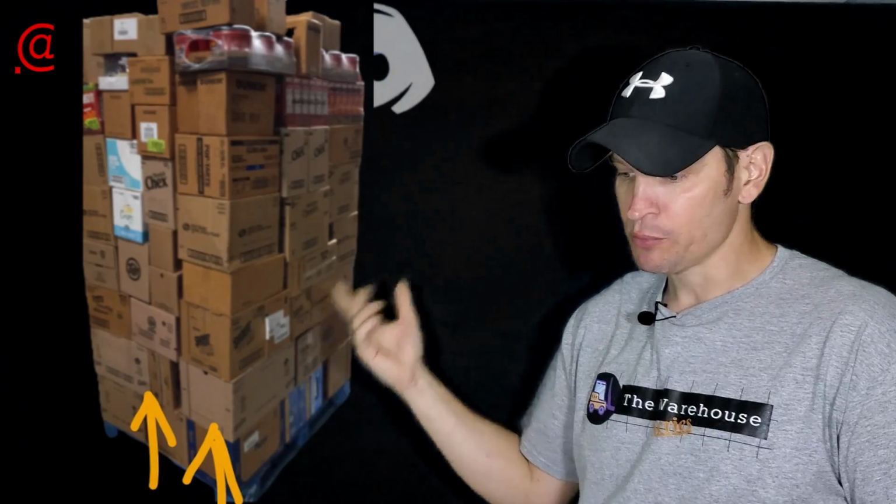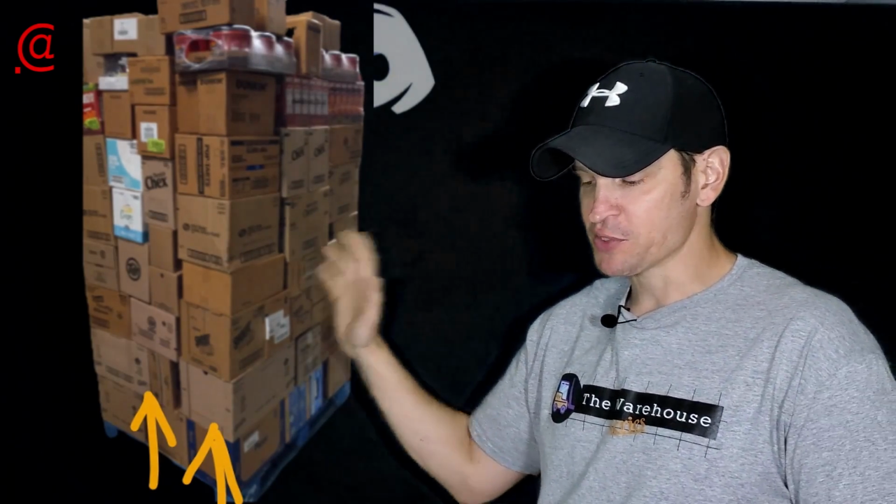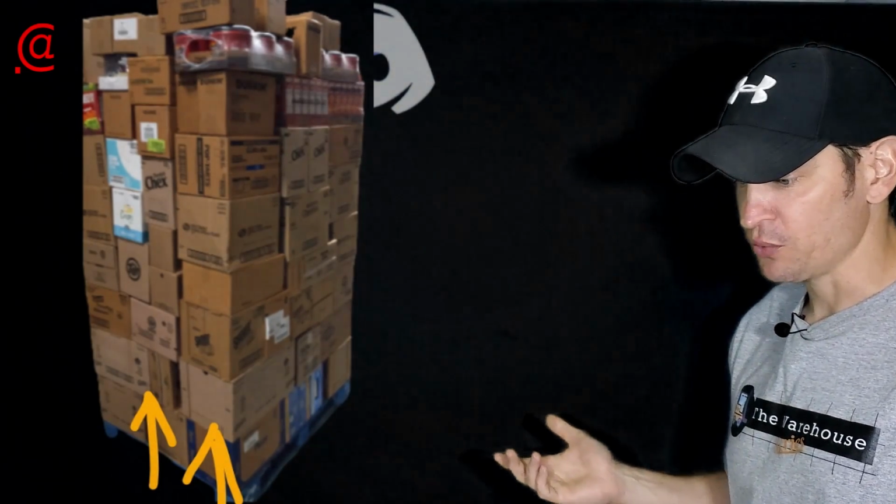If this column was vice versa, then if we even just went around the bend, this whole entire middle column would push our light corner over in a heartbeat. So even though this is column stacked, it's column stacked properly, because if this person needed to, which they obviously did not, you could just throw a thing of wrap around the middle of this pallet real quick and you could go about your way.